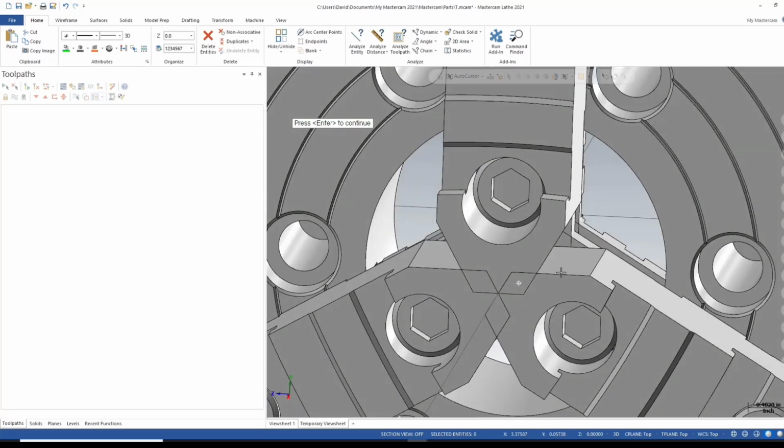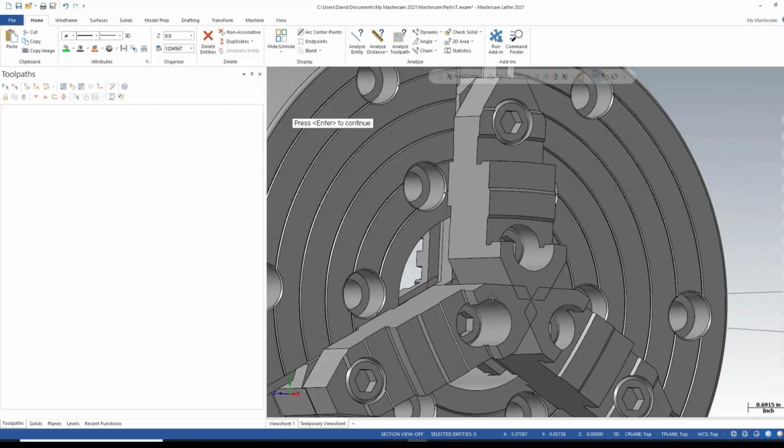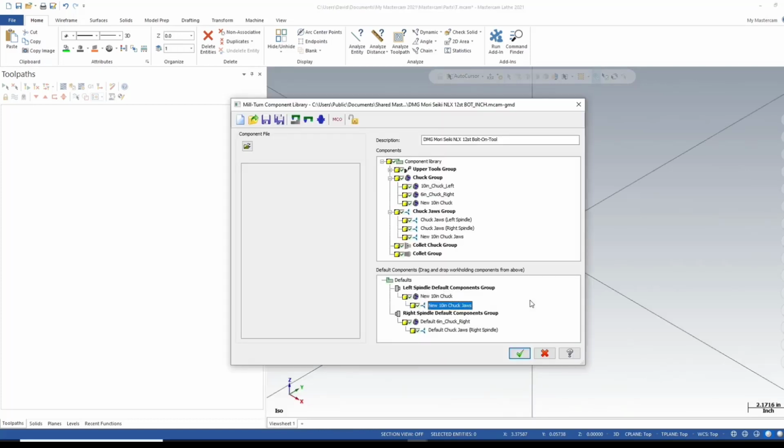So right now you see that the jaws are closing in on themselves. Not a problem. This changes when I go through my job setup, right? When I set my stock diameter, the chuck jaws will open up. So once I do this, in the next video, I'm going to load my collet. But what I'll do here is I'll hit save.